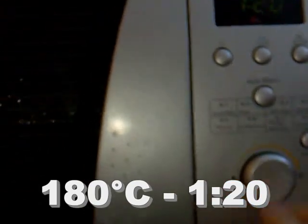Nothing's turning inside, of course. We'll wait about 50 seconds. Okay, it goes on now with 180 degrees for another minute and 20 seconds. Note it's been totally cold so it'll heat up gradually first. Next step is 210 degrees for just under a minute — it's going to be pretty tough already on the mainboard, which will smoke a bit.